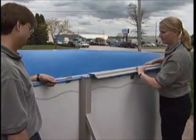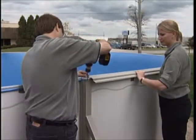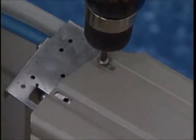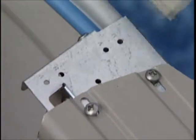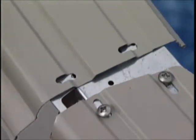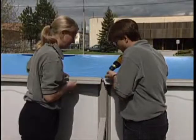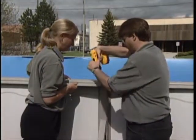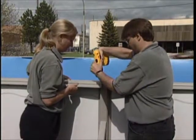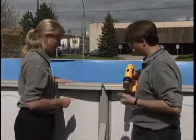The buttress top plates have a series of holes marked A and B. Only the transition rail is fastened to the buttress top plate through the holes marked B. Buttress rails are fastened through the holes marked A. Secure with 2 self-tapping screws, but do not tighten any of them fully just yet. Install the buttress rails first, and then the transition rails, before installing all the other top rails.